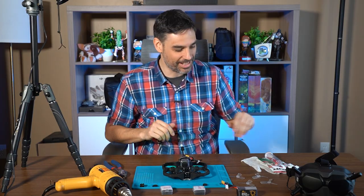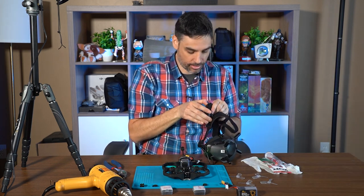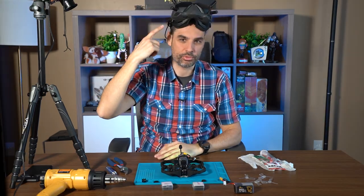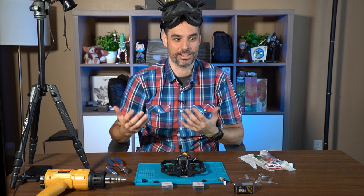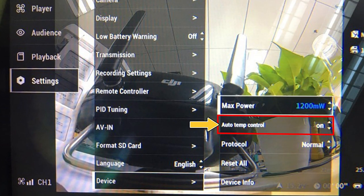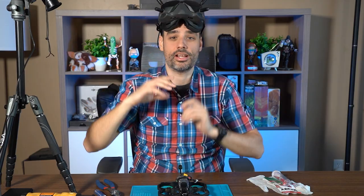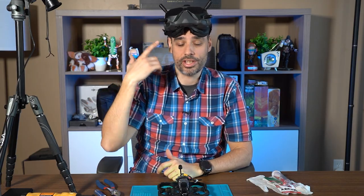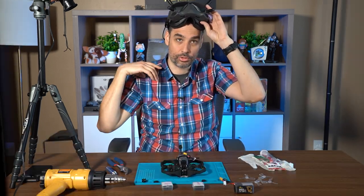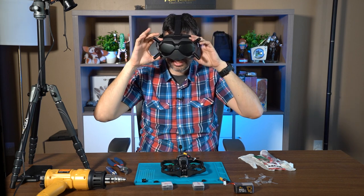Let's power up this little beast — put a battery in, it's gonna beep, watch out. Sorry for the loud beeps. Let's power on the drone and the goggles. By the way, if you can't record in your goggles, go into the menu — under Settings, then Device — there's 'Auto Temp Control' which is on by default. When it overheats it shuts down and you can't record. Make sure to deactivate Auto Temperature Control.